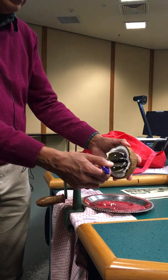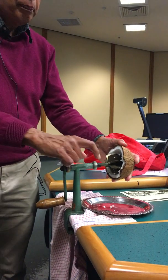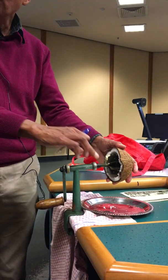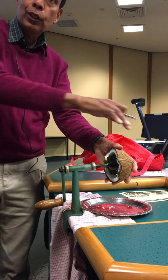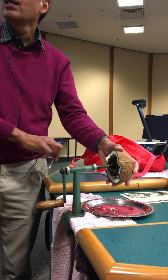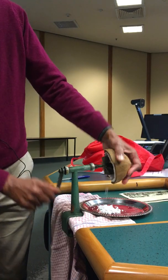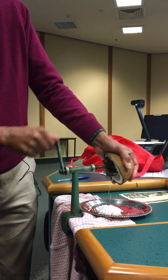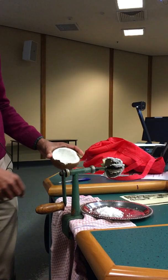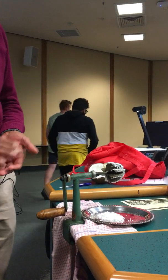I would also suggest you check the bending stress in the stem. This is not the actual specimen. You will find that the bending stress would be reasonable. There is also some axial stress which would be small compared to the bending stress, but you can look at the combination of axial compressive stress and compressive stress due to bending moment — and that would still be reasonable. I am not sure whether it is a good idea for health and safety reasons to let you eat it, but if you ever want to try it at home, this is the best thing you will do. Thank you.